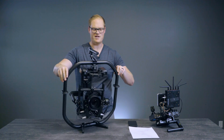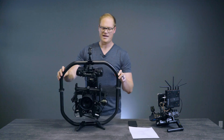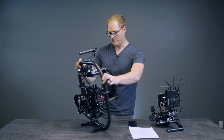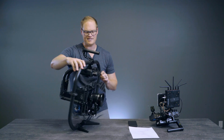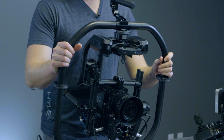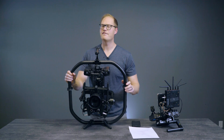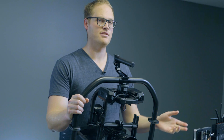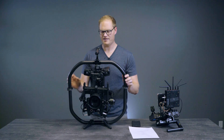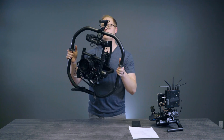As you set it up, you'll learn the limits for each axis. If you don't like this method of setup, you can definitely slow things down so that you never hit those acceleration limits. But as an operator, when you need to move the gimbal quickly, this is a really nice option to have — it just takes a little time to understand the limitations and work with them. Additionally, you can dive in and set different acceleration limits from slow, medium, fast, to unlimited, depending on your use case. You also have the ability to vary hold strengths to get the exact kind of behavior you desire: nice, fast, and precise control, but still with the level of smoothness you want.